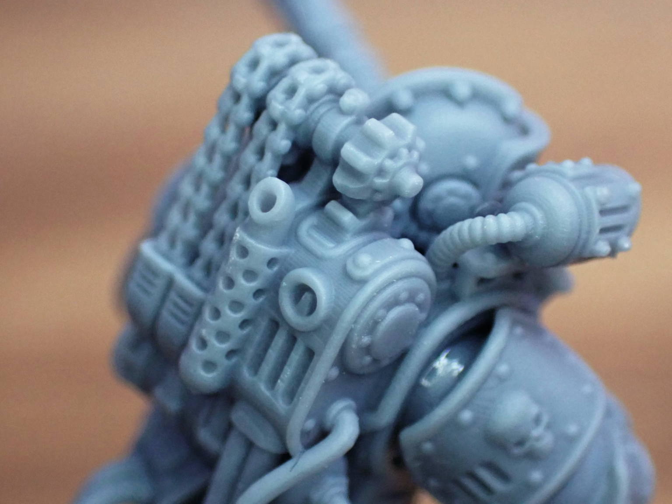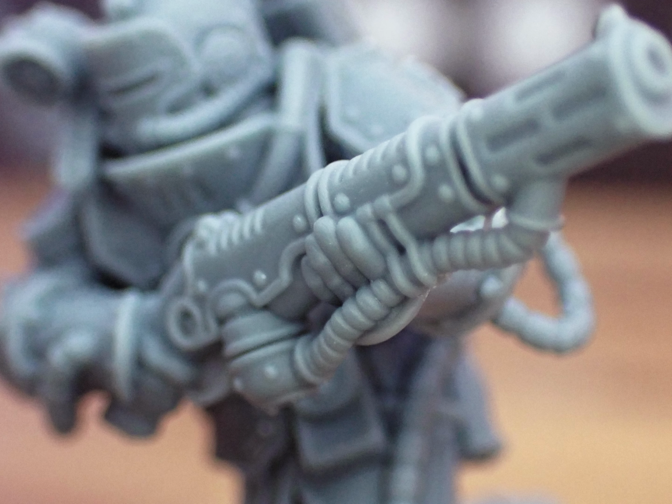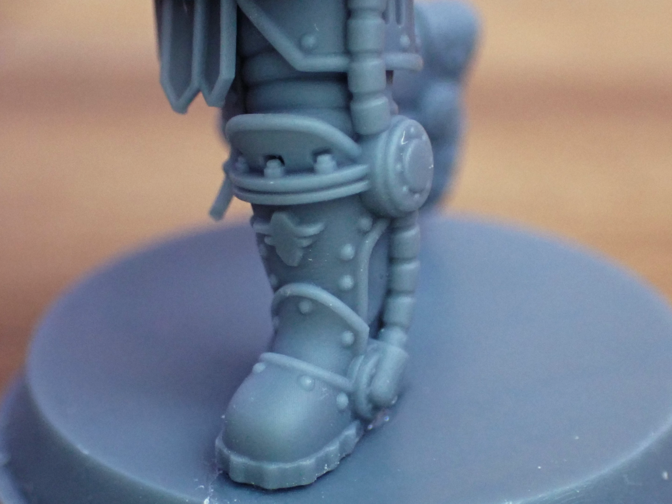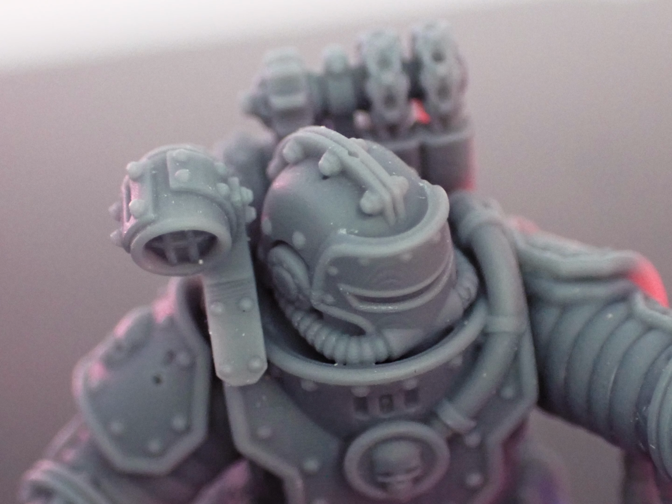The wash and cure station has no influence on the quality of the objects, unless you forget some resin in small cracks or holes in the model during manual washing. Then this residue is also cured and may swallow up important details. Automatic washing is not only faster, it also avoids such mistakes. The continuously moving washing medium in the container ensures that even the smallest holes and cracks in the objects are reached. And to be on the safe side, the rotor changes its direction in between and thus also the flow.